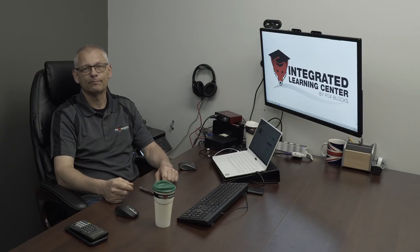You can go a little bit further than that. I did a house where the main floor was larger than the second floor - so basement and main floor were the same footprint, but the second floor was cut back about 20 feet. Normally you'd have that one wall that cuts all the way across and you would do that just in wood frame. I don't like doing that because now I've introduced fiberglass into the mix. You've got a whole energy-efficient house that's absolutely tight, and all of a sudden you've introduced a two-by-six wall full of fiberglass. I don't like that. So I told the engineer I want that wall concrete. I don't want any posts - I want that open all the way through. I want to be able to do a renovation 50 years from now, rip all the walls out, and that wall is going to stand up there by itself.